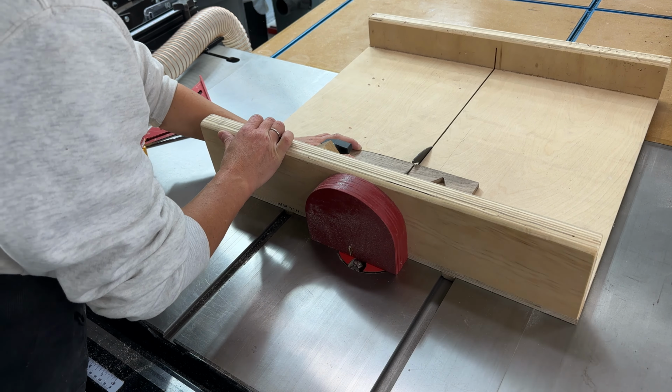Trim the inside pieces to be the same length as the outside pieces, and then just add a little bit of wood glue and glue it all together and clamp until dry, before finishing it with your favorite oil. And with that done, we now have 3 simple projects all made using the same router templates.